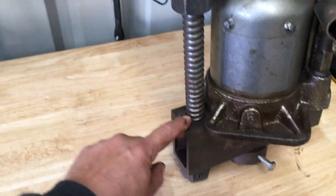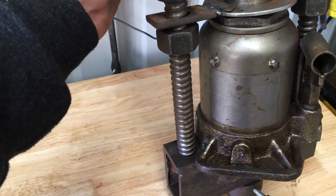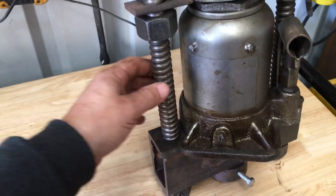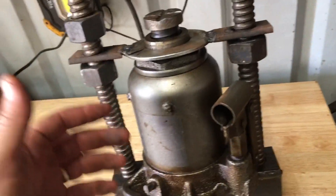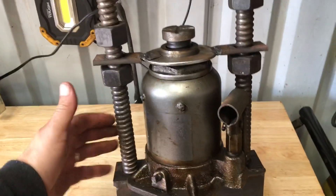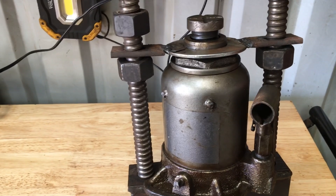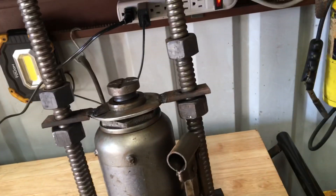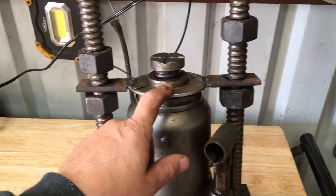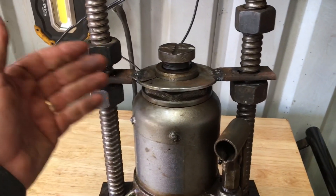If you've got a one inch drill bit it makes this easier. You could build this with three quarter inch rod, but one inch would probably be the smallest I'd go with a 20 ton jack. If you went with a 10 ton, you could easily adapt this to a porta-power. These rods can be cut to whatever length you need with a chop saw. It's a pretty simple little build — nothing complicated about it.